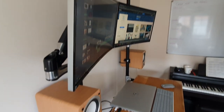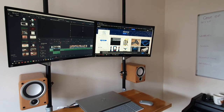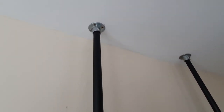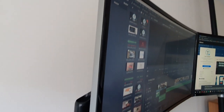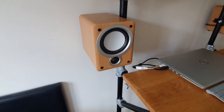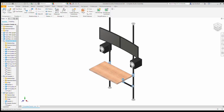Firstly I want to explain my reasons for using this design. I wanted to create a workspace in the spare room which would support the weight of two 27 inch monitors, which weigh 5kg each. I didn't want to screw the monitors into the wall as the walls are modern flimsy stud walls, so I decided to use steel tubes mounted between the ceiling and the floor to take the weight of the screen and the desk. I also wanted to be able to choose between a sitting and standing desk, so adjusting the height is no problem with this system.